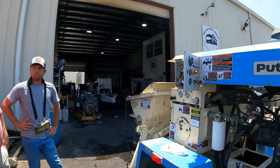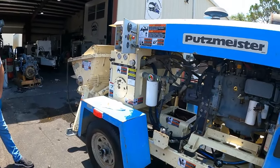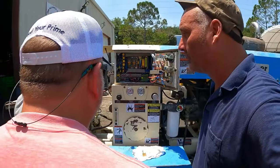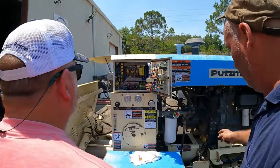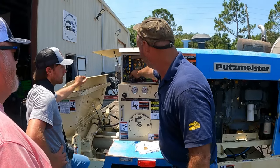They're pretty straightforward. I can get you a wire diagram on demand. I've got a thousand of them on the shelf. They're pretty easy. Every time I went through a pin, if you look in there, they're just numbered. They're all the same color, but they're numbered, and in the back, they're numbered. The keys are brown, and then a numerical number. You know, 17 might run to the switchover. 18 might run to the proximity switches. The blue ones are the proximity switches. There's four wires.